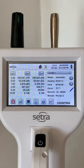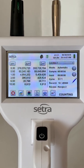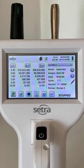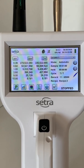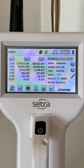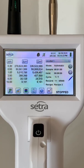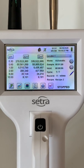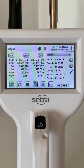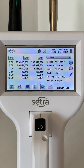I'll go back to the main screen so we can see the data accumulate — you can see the sample counting down with about 10 seconds left. So there we have it: all the particle counts for that sample. If we wanted to add any notes, we could just select that pencil button on the right-hand side. Then we can move on to the next location and take our next sample. If the next location had a larger volume and we needed a larger sample rate, we would have that already programmed in through the locations and recipes menu shown earlier. It's very intuitive and simple to set up, and once you have it set up, it's just go to that location, press run, get the particle count, and then view that data versus the historical data in the logs. You can also export all that data.